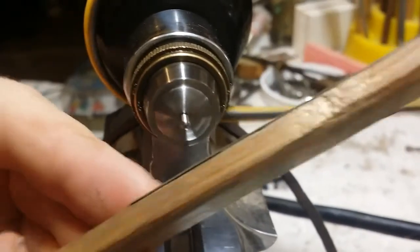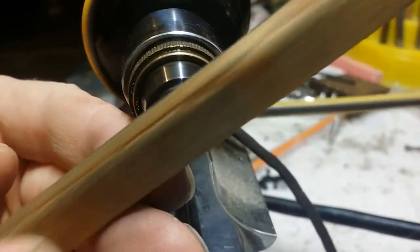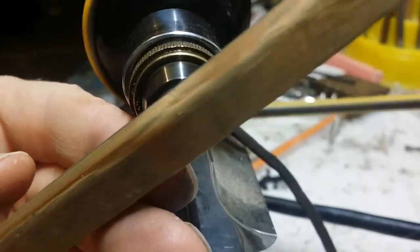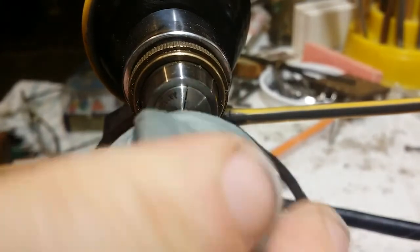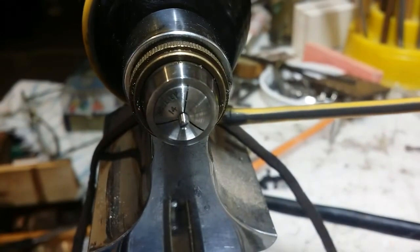I thought I'd explain to you what I'm doing here. I have some wooden sticks which I've attached wet dry sandpaper to, and I polish the screw head by going through this series of sticks. The first one, as you've already seen, was marked 250. It was 250 grit, and I use that primarily to remove any fire scale and any other major blemishes on the screw head.